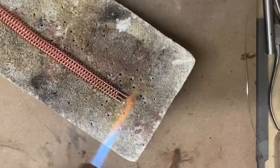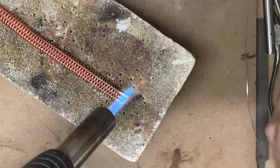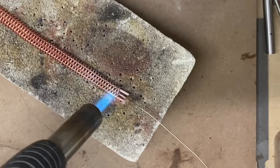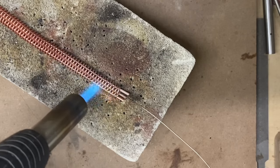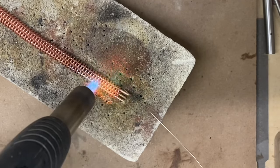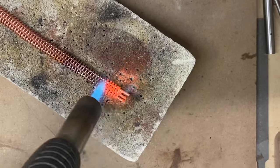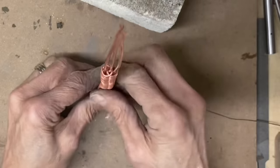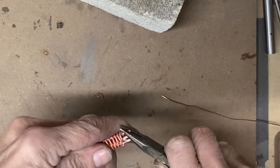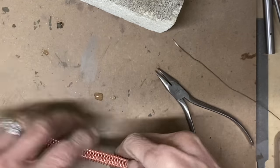Just keep working it until you get them nice and tight. We have to solder one end, so using the large butane torch I am heating that up and stick soldering in some hard solder. Stick soldering is just a matter of feeding in wire solder, and that way I know I get enough to attach those wires to the coils. Now I have one end that is soldered and I can push all the coils up really nice and tight.